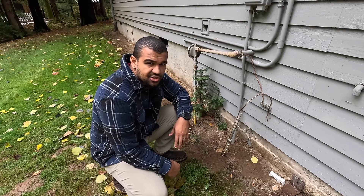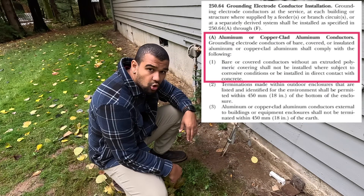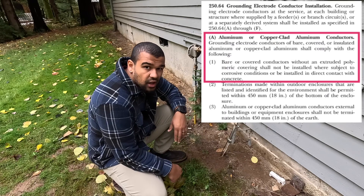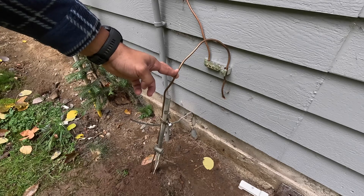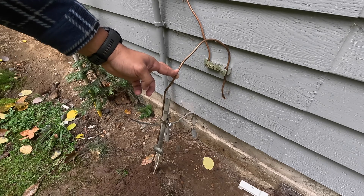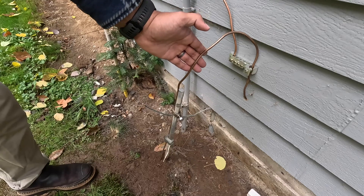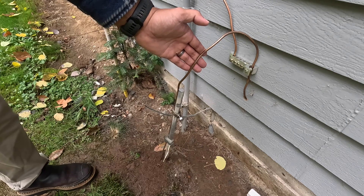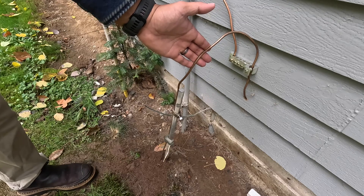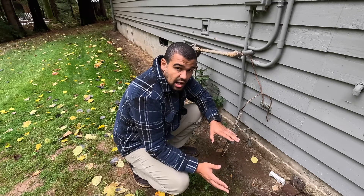The last thing I want to touch on is the use of copper versus aluminum in your grounding system. The NEC only allows you to use copper for your underground grounding connection — you cannot use aluminum. Aluminum doesn't patina like copper; it will corrode underground when in contact with soil, which is why aluminum is not allowed for any part of your underground grounding system. When copper oxidizes, it forms a protective layer called patina. This layer is what gives copper its strength against corrosion and lets it last over 40 years underground. My recommendation for any grounding system is to use copper any time possible.